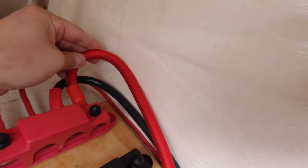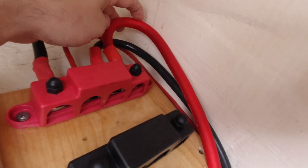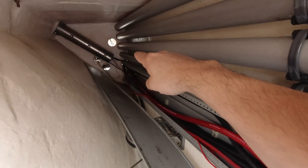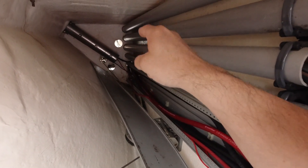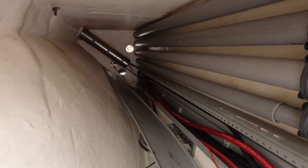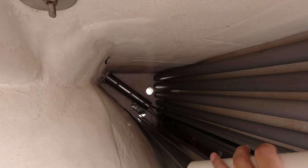This big hunk of wire here - I know it's oversized - is the jumper cable, the battery combine. It's going to run through that fresh hole right there, through this compartment at the aft of the boat, into the other engine compartment. I've drilled that hole for a piece of PVC pipe to work as a wire chase, and that's what I'm getting ready to put in.